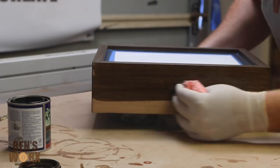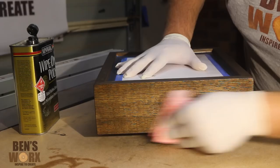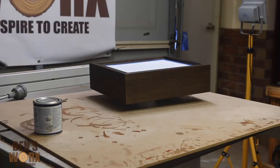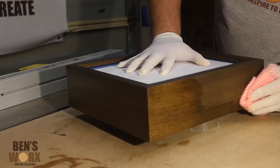I think the stain turned out quite well — I was expecting it to be a bit darker though. To seal the stain, I'm just going to use some wipe-on poly, and I've got this one in clear satin. I've made sure to use painter's tape to cover the resin up. I've used clear tape in the past and found it just leaves marks on the resin.